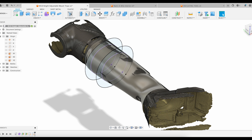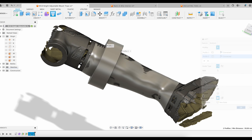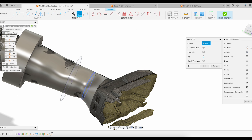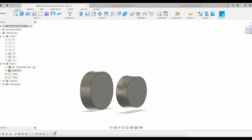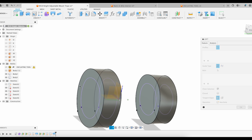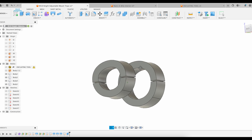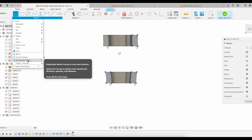I offset that surface again and now I'm going to do a loft between those two surfaces, and that's going to end up being my solid area. I need to do this one more time, offset by 100 millimeters to give me the area for the second clamp - just two areas is all that I planned to use. It did make these two pieces solid, so I ended up turning those sketches back on and doing a couple of lofted cuts, same way that I created the solid but just doing a cut instead of an extrude. I cut and removed two millimeters of the surface, which will actually give me that pinching force.